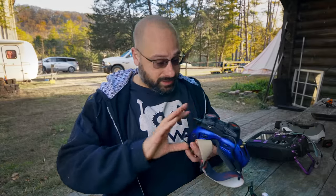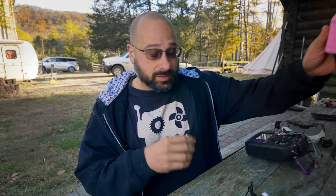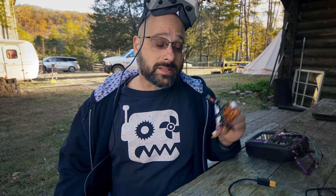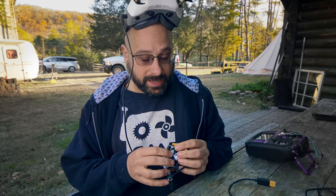I was about to say, I'm not really having that problem with the HDZero quad. I can see a lot more than with analog. Anybody who says that HDZero doesn't have significantly better image quality than analog is crazy. I think we're gonna see even better image quality on the Walksnail video transmitter. I don't know, only one way to find out. Now the Walksnail video transmitter goes up to 350 milliwatts, which is more than the 200 milliwatts of the HDZero, but not quite as much as the 450 of the analog.